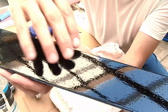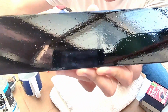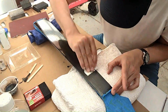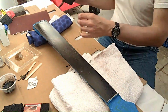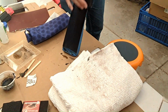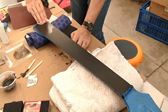It might be that the wood will be shining through it at some spots, but we have to be quite strict here. Sanding epoxy is a bit different to wood. It will stick on sandpaper and make it dull, so you need new pieces frequently. I like sanding wet with sanding sponges. It's an even sand, and the grain coming off stays in the liquid and keeps working.